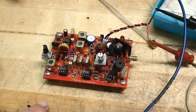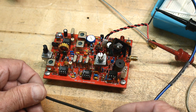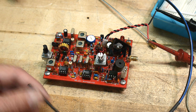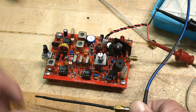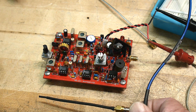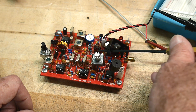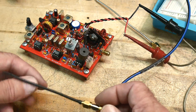There are other probe designs that have a capacitor and a resistor in the tip — that's fine, then you have DC blocking right away in the probe itself. I have a DC block on my spectrum analyzer already, and since it's insulated it shouldn't be an issue anyway. There is another one you can buy that is basically an FET amplifier on a little PC board, so instead of running this into an LNA and then into the spectrum analyzer, the LNA is right next to the probe itself — it reduces noise in the system. Those are nice too. I've just never found a need for one. Anyway, there you go — probing around with something other than a scope probe.